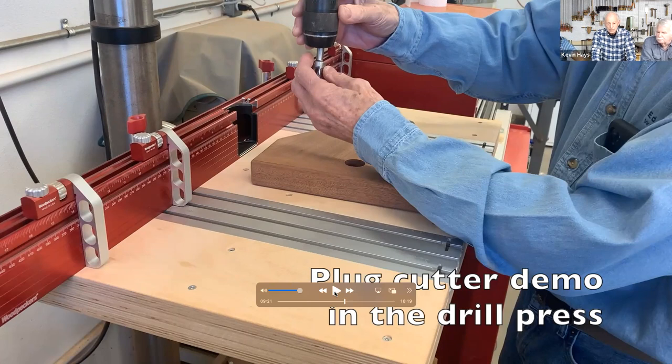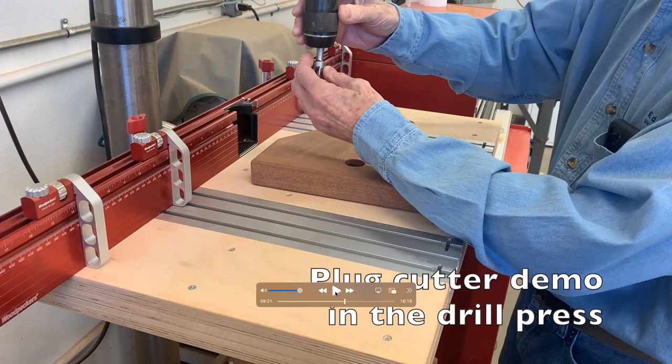Because on this one, there's a speed change. Speed is separate, the switch on the back. Speed is separate from torque. Sometimes you want it to cut faster as a drill, and there are 2 speeds, so that really is not part of the conversation for the clutch. So that 1 and 2 means something. He was wrong, your husband, that wasn't the clutch he was talking about, that was the speed. Yeah, that's how my drill is too. It's like first gear and third gear on a car. Husband, this is not the torque, this is the speed.